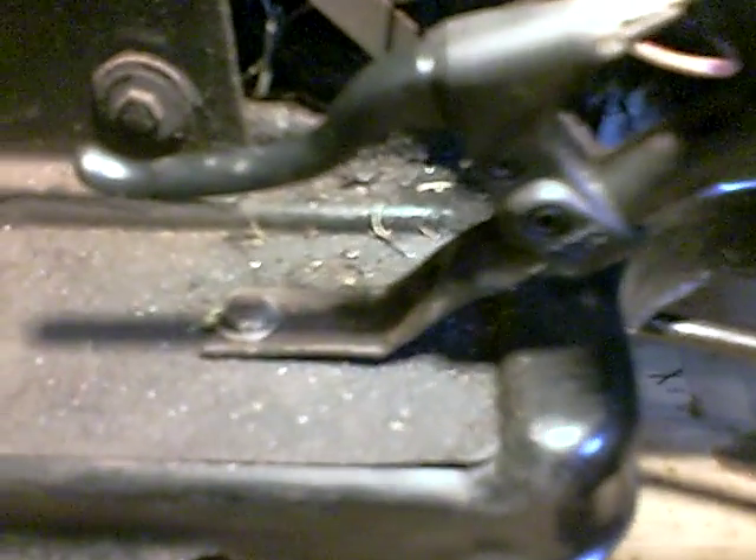I pulled a little bolt through it so when it doesn't come back on me, it slides into the track there. Now, that's for my arm that I use — I know it's a bit long, but I like it. It just was off a push mower, the handle. Right there is the indentation where the two pieces of handle meet, so you can fold them in half. I just flattened it out using the vise, gave it a 90-degree bend, and drilled a hole there. That made the bicycle handle much higher, making it better.